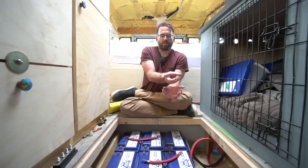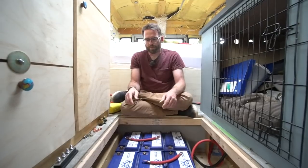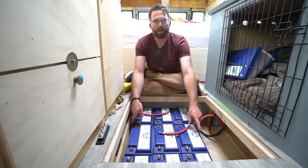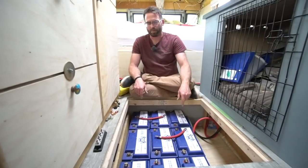So what we're going to do is go 12, 12, 12, 12, 12 across this way instead. By bisecting the direction that the current flows out of these batteries, we're giving the current an equal opportunity to discharge and return back in the loop of the path.